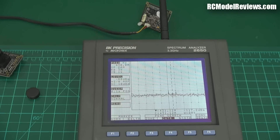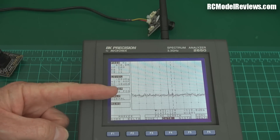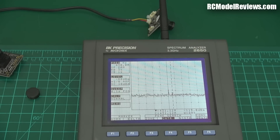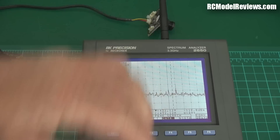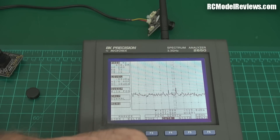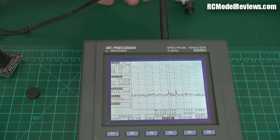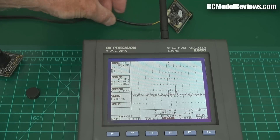Now let's look at the spectrum analysis. Many people complained this camera was noisy on UHF. I have the new version — supposedly the one with lower emissions — connected up, with the spectrum analyzer gain wound right up and a noise floor around minus 117 dBm. When I plug in the camera, there's a very specific, narrow spike visible, but the noise floor itself stays down around minus 116 dBm. And when I hold the power cable right against the antenna, there's very little increase in noise. That's the new camera.